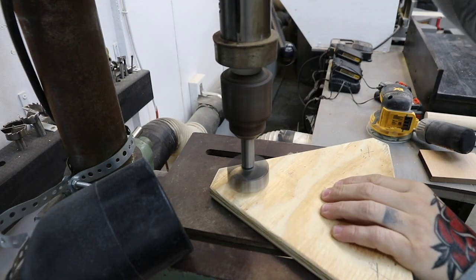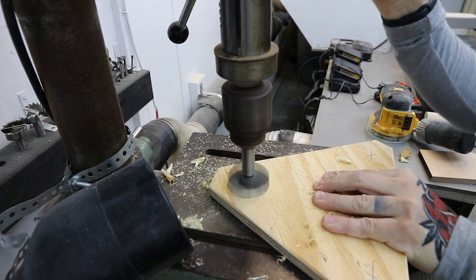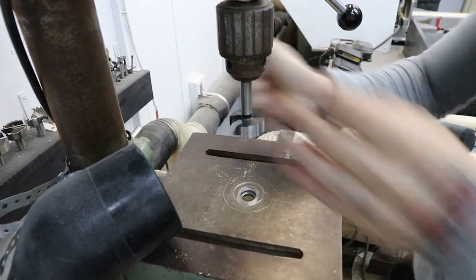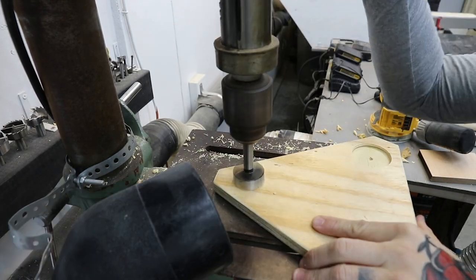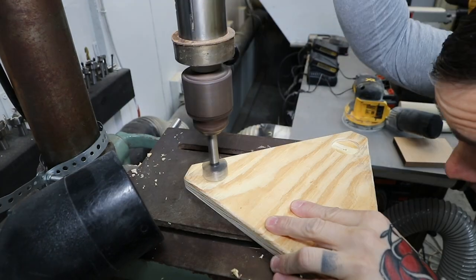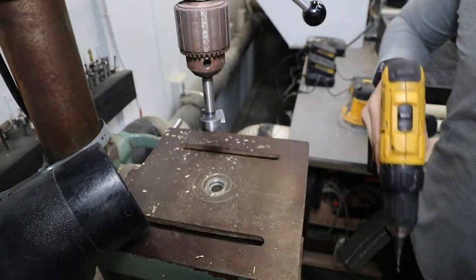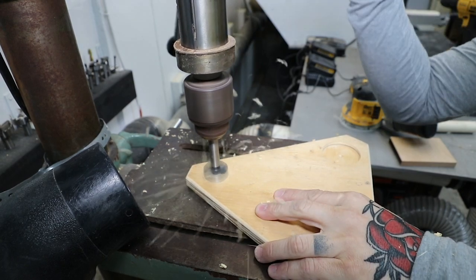I drill a 2-inch hole into one of the corners on each piece. This shallow hole is 1/4 inch deep. I remove that bit, put in a 1.5-inch bit, and drill a shallow hole into the second corner of each triangle. The last hole size is 1.25 inches. This goes into the 3rd corner of each triangle. After those are done, I drill through the center. Then I flip them over and drill the same holes on the backside.